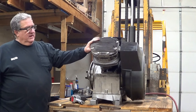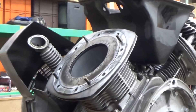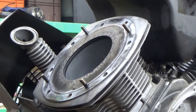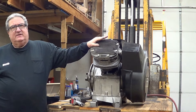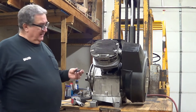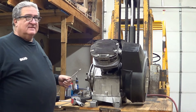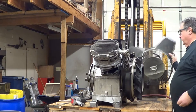So here we go. We've got to pull our head off, and before we do that I want to show you the other side real quick. It was interesting that this compressor did not have a tag on it, but we knew it was an Atlas Copco because of the fan cover. The other head was off because we took it off to get the bore and stroke, and we were able to find out this is an LE20 machine and then got the parts book. So we're going to start tearing her apart now. There's only two bolt sizes I've found on this so far — 17mm and 13mm. There are only four bolts holding the fan cover on. I'll give Atlas a thumbs up for that.